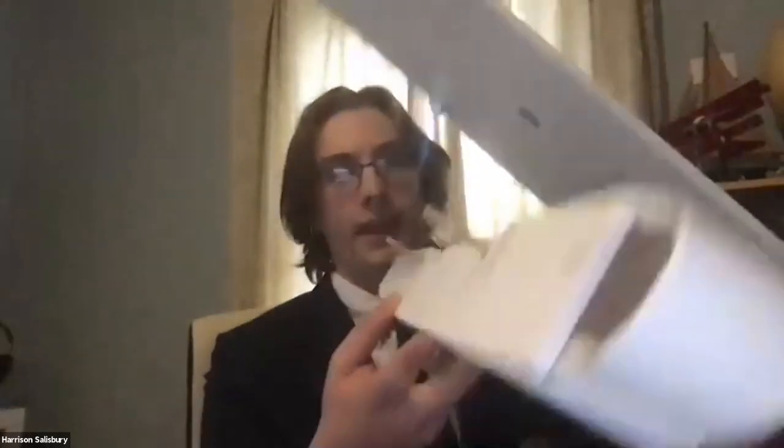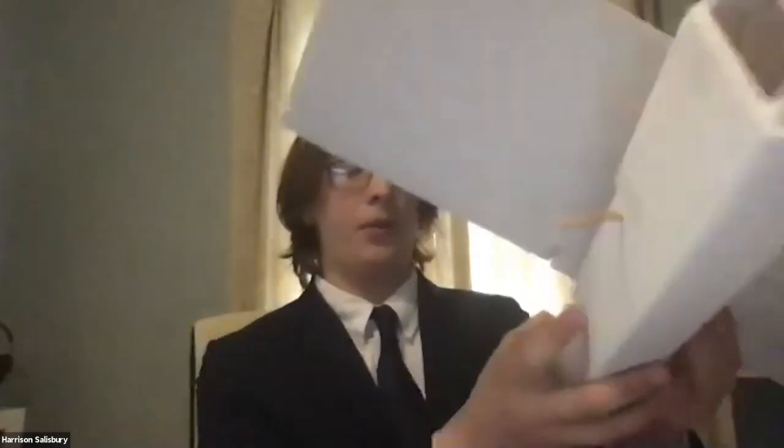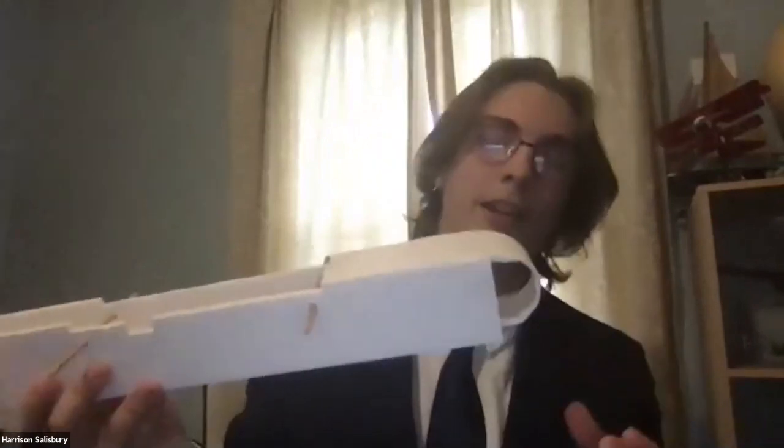So I also have here with me the cannibalized parts of the original build, like the wing, the fuselages, and the stabilizer and rudder. Although they're a bit destroyed, I wanted to talk about how my design changed going from the big to the small. For the big drone, I wanted to make everything almost as loose as possible. So I had the wing attached to the fuselages by rubber bands, and dowels through the fuselages. And the front of the fuselage is just paper in a bent, slightly aerodynamic shape.